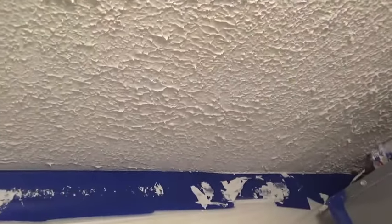I had to stop because of the ceiling leak. As a final step to the texturing, what I've done in the past is take a stiff piece of cardboard and rub the edge of it across the ceiling to knock down any of these spikes that seem to be sticking out too much. Because I don't want to have an excessively sharp texture to the ceiling — sometimes the roller can leave things in sort of sharp jagged pieces pulling out of the ceiling, and I just like to break those off with the edge of a cardboard box lid or something like that. So it's not quite as jagged.